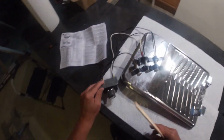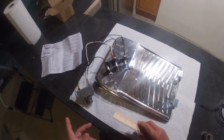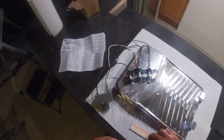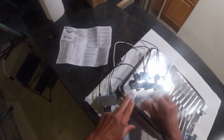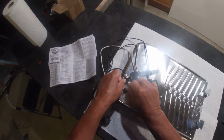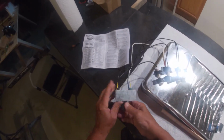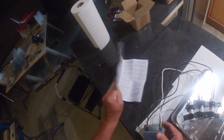For the testing portion of this effort, I've set up my reconditioned Weber igniter with its 3 igniter probes taped to the bottom side of this metal paint roller tray, so the metal portions of the igniter probes make good electrical contact with the metal tray itself. I did this because I suspected that the Weber igniter system works similar to an automobile engine block that serves as the electrical system's negative to ground surface. In other words, this metal paint tray simulates the metallic negative to ground Weber grill chassis. I also connected the igniter wires per these Weber igniter replacement kit pictorial instructions.